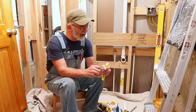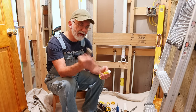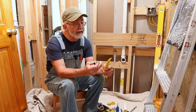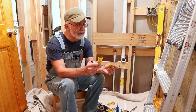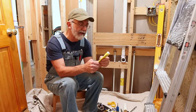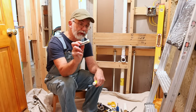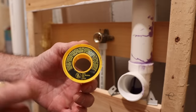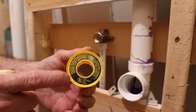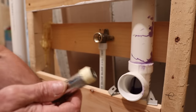And so I did, and he was right. On all the years after, on a threaded connection, never had a leak because I wrapped it with Teflon tape, then put the pipe dope on. I'm partial, for what it's worth, to Rector Seal Number Five — pipe thread sealant. I don't know if they have other numbers, but this is what I get. I should say there is a difference in Teflon tapes. If you buy the cheapest stuff, you might regret it. Just buy good quality Teflon tape — it's more expensive, it's thicker, and it's better. Don't take a chance, get the good stuff.